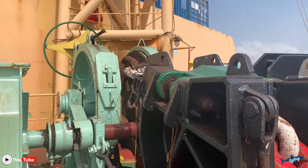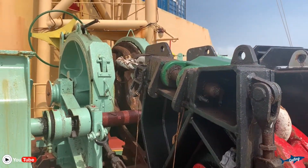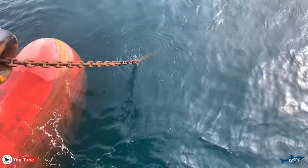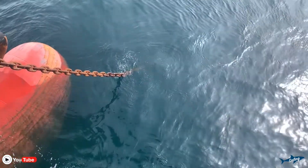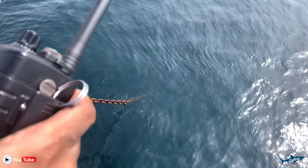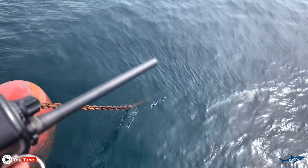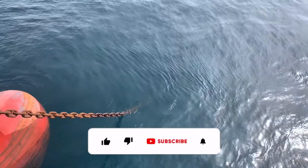These two safety measures are there to protect the anchor chain from slipping. This is how we secure our anchor chain once the anchoring or dropping of anchor is finished. Now, before the chain was up and down, and now it is leading to one o'clock — short stay. How we say one o'clock: same as you see on your normal wall clock, you have directions — one, two, three, four — so we take our ship's heading as 12 o'clock and then start on the starboard side: one o'clock, more starboard two o'clock, three o'clock, and so on. We follow the clock to give the direction of the chain.